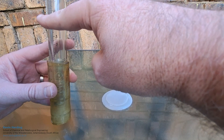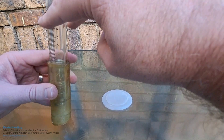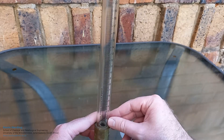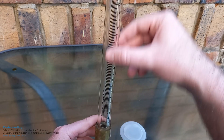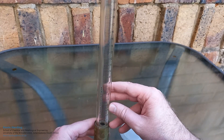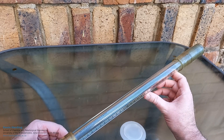In reality, all those calculations that we're doing in the notes, you'll never really have to use them in practice. The one thing that you will have to take into account is the type of fluid flowing through here — we'll get conversion charts for densities, temperature corrections, and various correction charts. But other than that, it's as simple as that: a tube, read off the flow rate, and you're done.